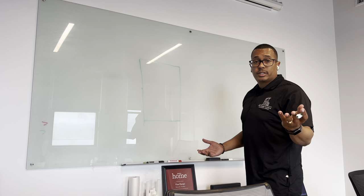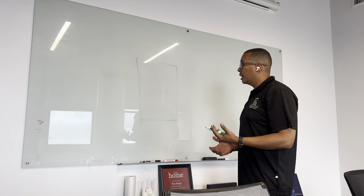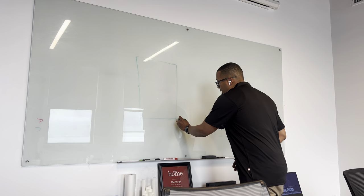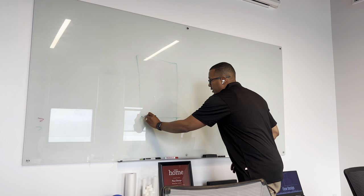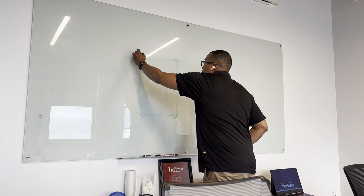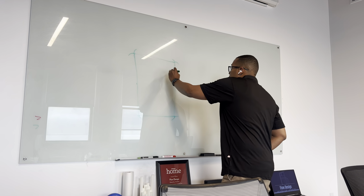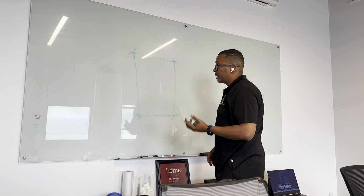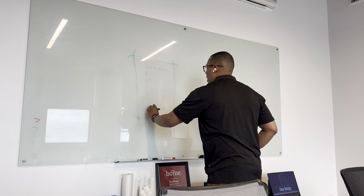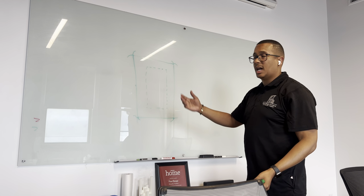Alright? So lots are delineated by a professional land surveyor. The professional land surveyor finds something called bounds and rebars. Rebars are bounds or points that denote where the legal corners of the property are. Okay? The surveyor gives you the property and tells you where it is. We architects look for zoning and understand the setbacks and all of the requirements, and let's say these are the setbacks, and within those setbacks we're supposed to build something inside.